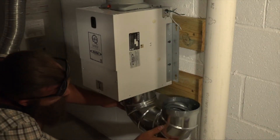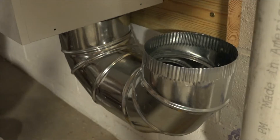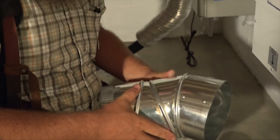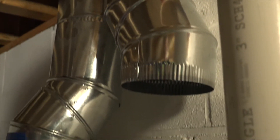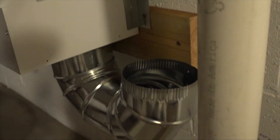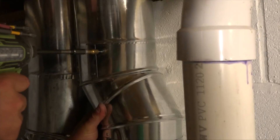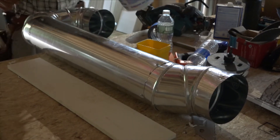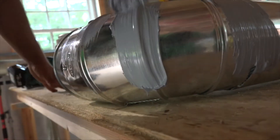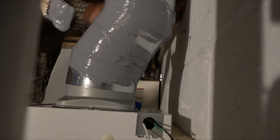Because this is a 6-inch duct, there's plenty of volume to overcome the pressure loss from a direct 180-degree turn right out of the fan box. It's back to Rubik's elbow — with the top and bottom fittings set, he cuts a piece to fit between, then removes the lower elbow. Working downward, the ducts are screwed together into a single unit. He moves it upstairs to his bench and seals it with mastic, painting every joint and gap thick. In the basement, he seals the duct work that is still in place.